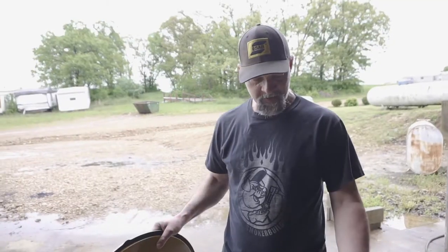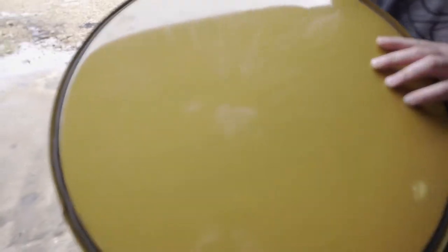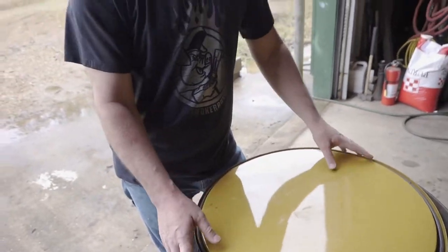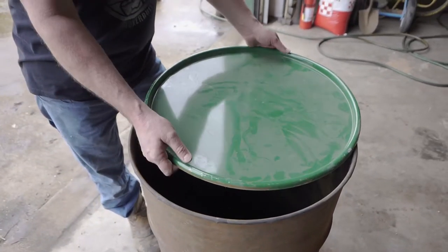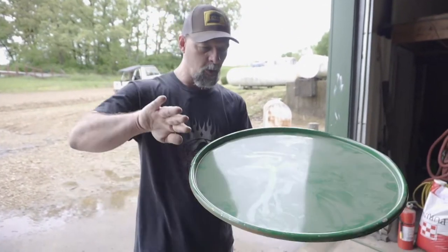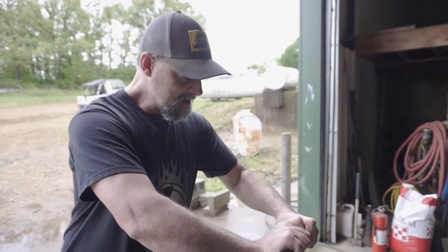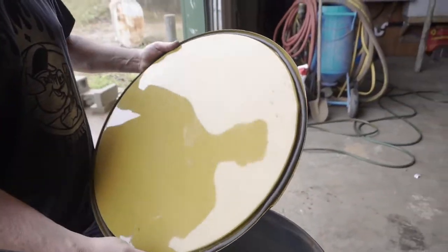We've got the inside of our barrel cleaned out. There's some rust in there that doesn't bug me at all. We're going to look at this liner on this lid and how to get rid of that liner and this gasket right here. Usually what we do — this lid is pretty thin, probably like 28 gauge or something. We don't want to burn this off. A lot of guys, I see them build their fire, get it going, and set the lid on it or wedge it up on a stick. But that's kind of a bad idea because this will do what we call the taco effect — it'll turn into a taco and you'll have a tough time getting it back flat. So we actually use a grinder or sanding disc to get this lid right. But I'm going to heat this up a little bit and melt the glue and pull this out, so I've got to go get a heat gun.